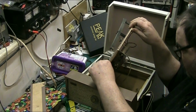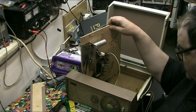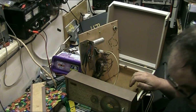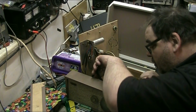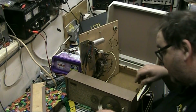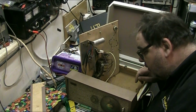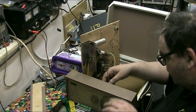Oh, I almost forgot. It's got one of those across the line capacitors, you know, they kind of like to go bang when you least expect it. And it's been dripping on one of the IF transformers. So what we'll do, oh, it's already been disconnected, that. Somebody's already disconnected that, it's desoldered. Well, somebody's obviously thought forget it, so